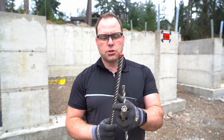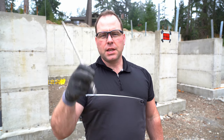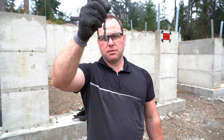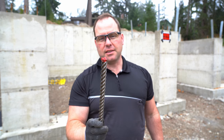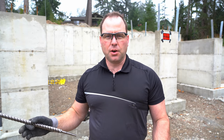As soon as you hit concrete, pull it out — this bit is only made for drilling rebar. One of the big reasons why standard bits don't work well on rebar is the percussive action of a rotary hammer. As it drills with that percussive motion, the bit gets hot and will break off. But these rebar cutting bits are designed to withstand the heat.